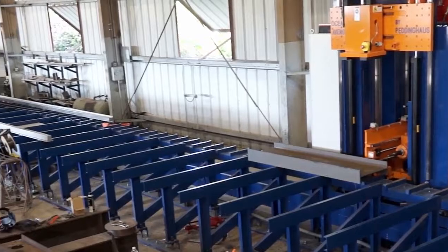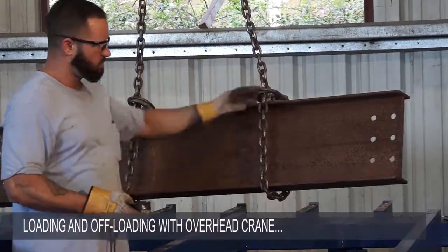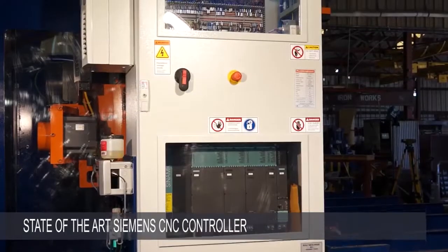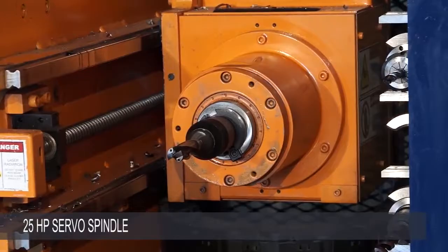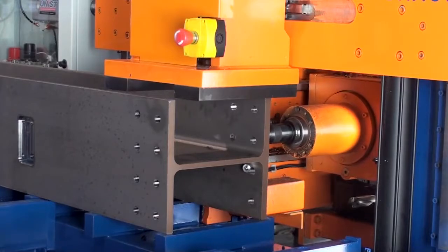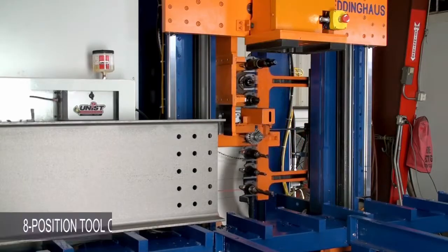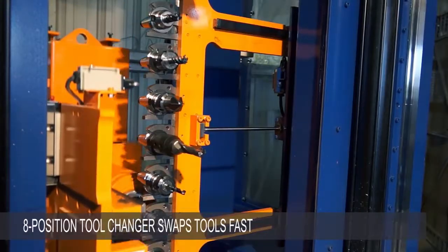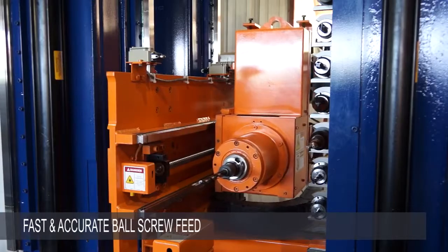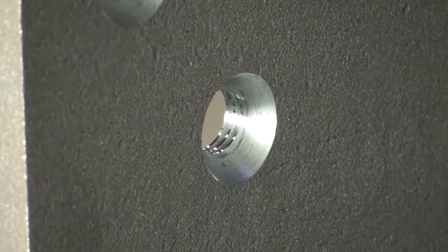The Avenger Plus can be purchased in any length from 20 foot to well over 100 foot. The machine table is designed to allow easy loading and offloading with an overhead crane or forklift. The state-of-the-art Siemens CNC control drives a 25 horsepower servo spindle in infinitely adjustable speeds up to 3000 RPM, making it ideal for drilling with carbide tooling that makes light work of heavy parts. The 8 position tool changer facilitates fast swapping out of tools as well as automatic tool length measurement. The fast and accurate ball screw feed combined with tool measurement allows for precise, user defined milling depths for surface milling, countersinking and counterboring.